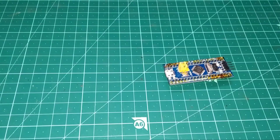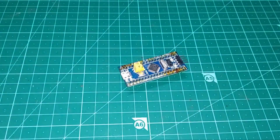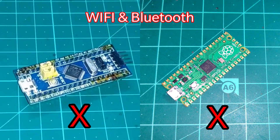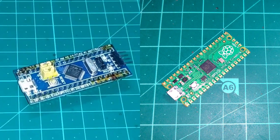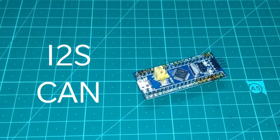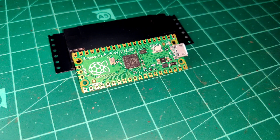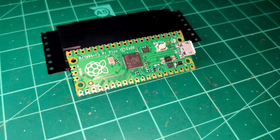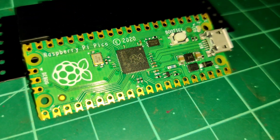Last but not the least, the STM32 boards — Blue Pill and Black Pill — are also strong competitors because they are similar to Pico. They also don't have Wi-Fi and Bluetooth, are clocked higher than regular Arduinos, and share a similar feature set, while Pico has more memory. On the other side, STM32s have I2S and CAN, and they both have an onboard clock and temperature sensor. In my opinion both have their own edge and are similar for most project scenarios. But since Pico is new and has better documentation and support, my pick would be Pico over STM32 because of simplicity and documentation.